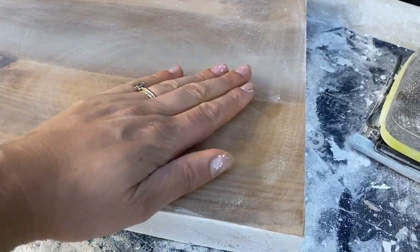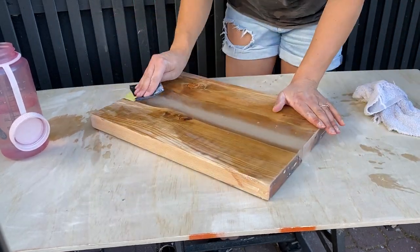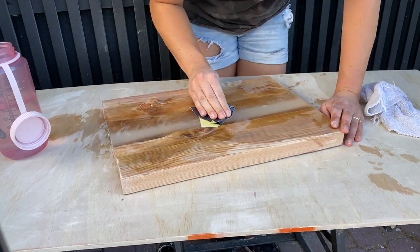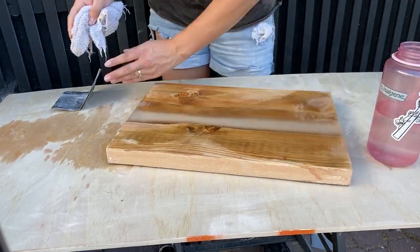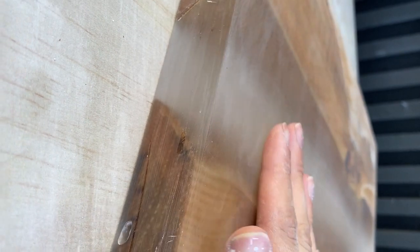At this point I could see little sanding marks from the electric sander, so I went up to my highest grit sandpaper — a wet sand — and did that by hand just to really pay attention to getting those marks out. Once I was happy with that, it still wasn't clear. You have to trust the process because it looks cloudy from sanding after you made it so perfectly clear with your pours. Clean it up with water and that gives you a little more confidence. Before the top coat, clean it with alcohol to remove any dust from the sanding process.